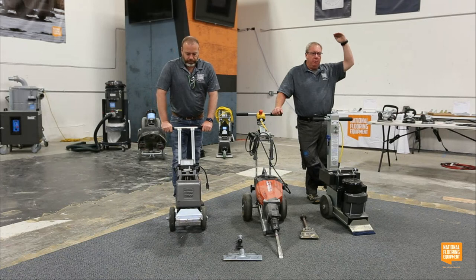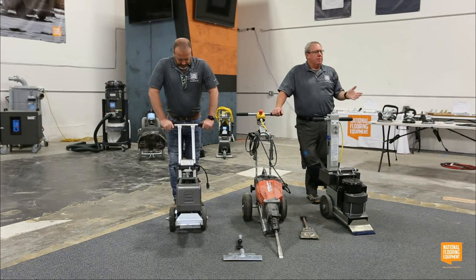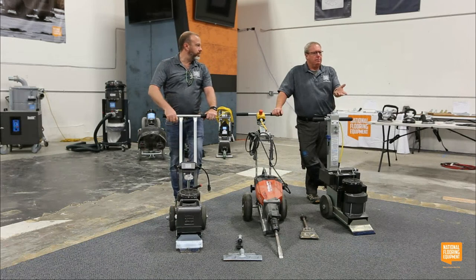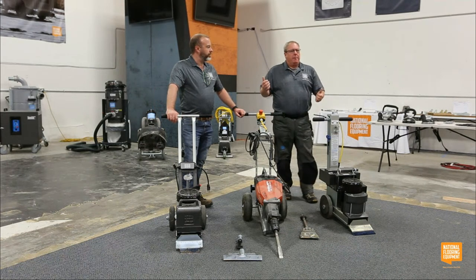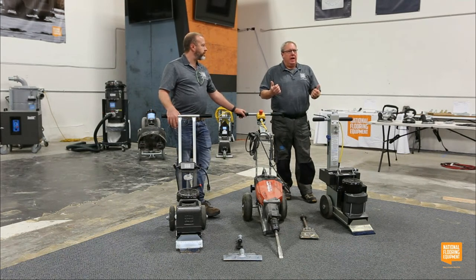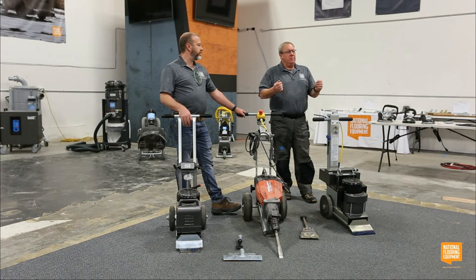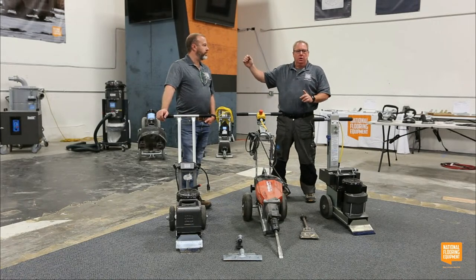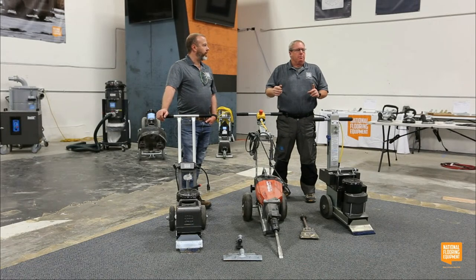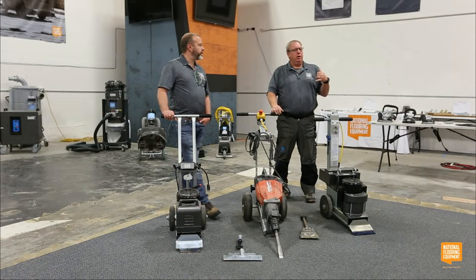Maybe you graduated from Pepperdine and you're smart, but you're not on the job site, and you've hired some young kids that have great attitudes and strong backs. But they turn on their equipment, and it keeps tripping the breaker. What they've done is plug the vacuum over here and the grinder, the shop blaster, over here, and it's tripping the breaker. So they'll call me going, this thing keeps tripping the breaker.